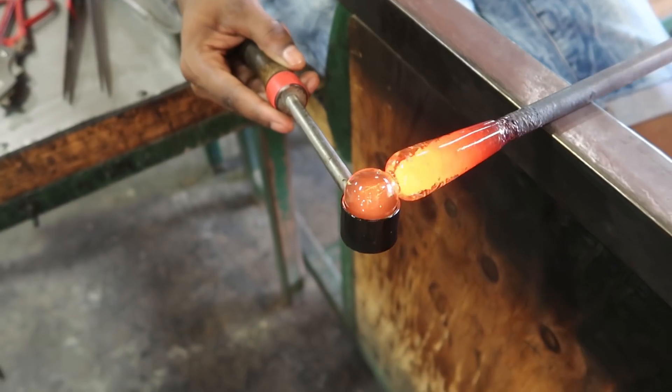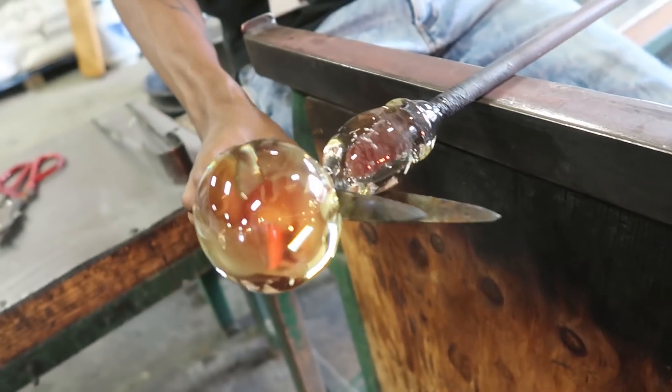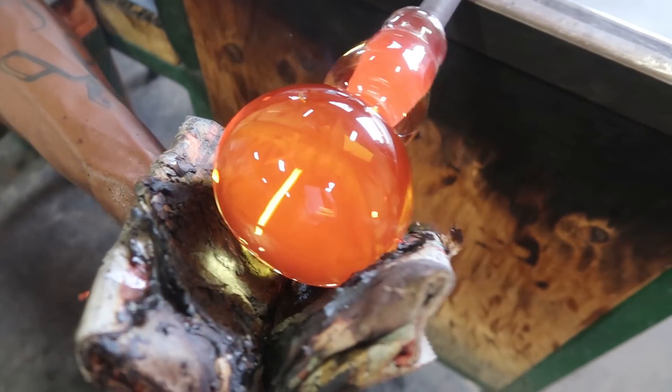While we're running our unannealed test, we're going to start making glass balls in different sizes that will eventually anneal. We're going to start with something about the size of a cherry, then work up to a golf ball, then about a large grapefruit, and then as big as we can — a small pumpkin. A baby melon. All right, so how long are we going to put those in the annealer? We're going to keep them in there for about 14 hours. After 14 hours, all the stress points will be worked out, and we can essentially bounce them on the ground — throw them in the mailbox, play basketball, have a lot of fun with it.